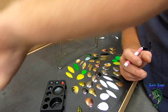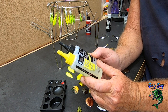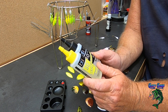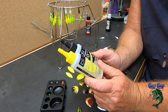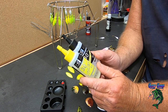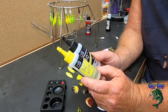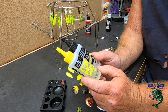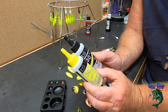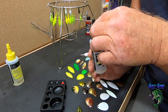And what I'm using for epoxy is I went and got some of this at Hobby Lobby when I was over there the last time picking up some paints. And I tried this, and I know in the other video I talked about using the testers, but I think the testers took a lot of time to dry. This cures in like 30 minutes. Some people use this on their lures and stuff. I have a couple lures I used it on, but I'm just a big fan of the UV epoxy. It just seems like this stuff hardens so fast that you can only get one or two baits before you have to clean out your brush, and it's already gummy and hard. So if you're only doing one lure, I guess it would be all right. And I don't think it spreads as smooth.